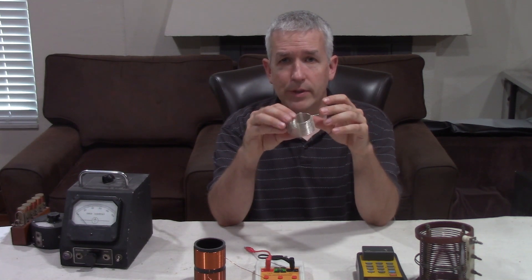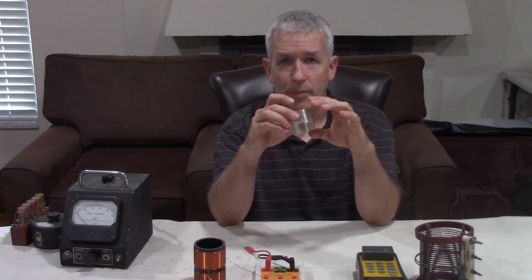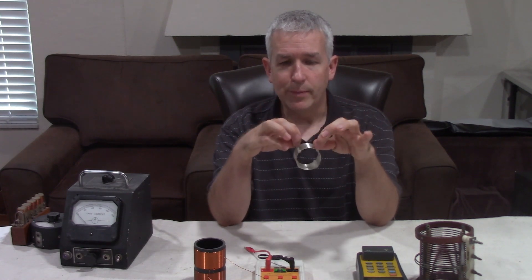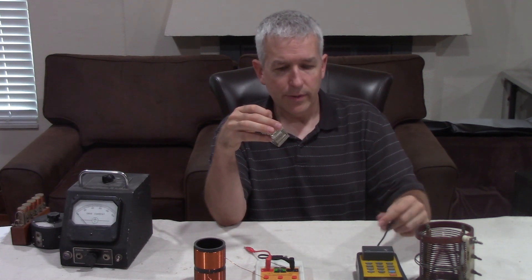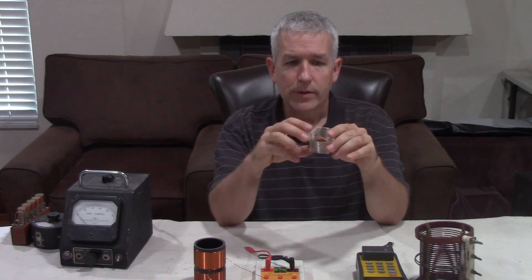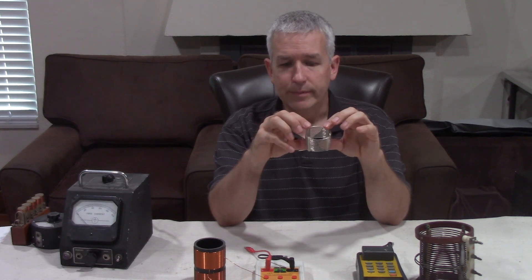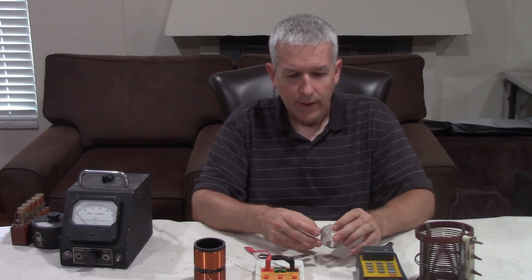You can go into additional calculators to find the length of wire based on those measurements. You have to measure the pigtails for the length of wire too — the coil calculator only calculates the actual coil without the pigtails. Add those, including any clips from your frequency generator. Measuring that whole length will give you your natural capacitance and natural inductance calculations.